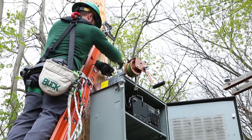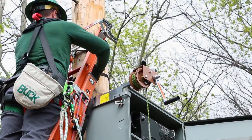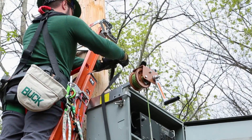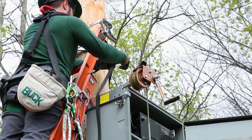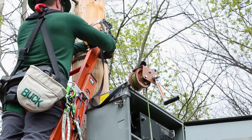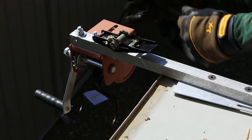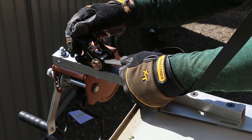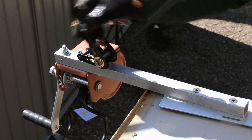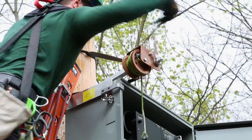This will secure the mounting winch bracket to the cabinet. Wrap the 1-inch web sling around the pole, passing the working end of the strap through the sewn eye to securely fasten around the pole. With the 1-inch web sling mounted approximately 12 inches above the top of the cabinet, place the free end of the 1-inch strap onto the ratchet binder, pull until snug, and ratchet until the mounting winch bracket is no longer supported by the cabinet.